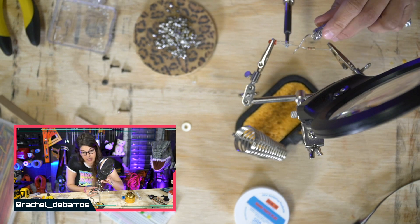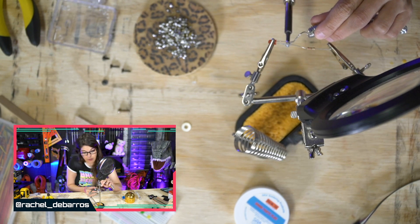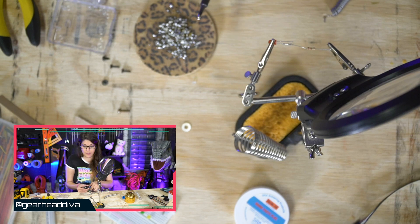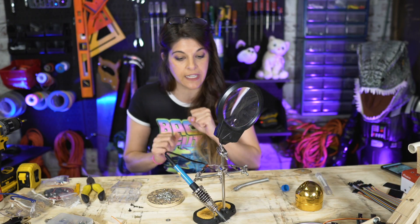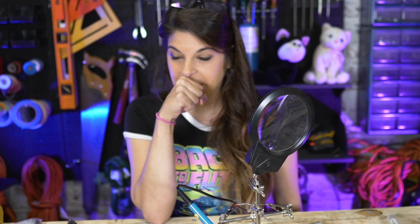That way when I apply the solder on top it'll wick through. I'm going to let that cool off. Next, I'm going to hook up our positive to the other end and then the negative, using heat shrink tubing. I always forget to put that on first and then I have to cut the wire. I admit, I just do electrical tape sometimes — so that's our secret.